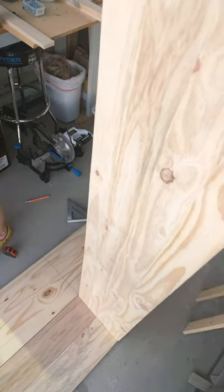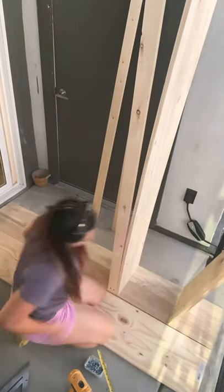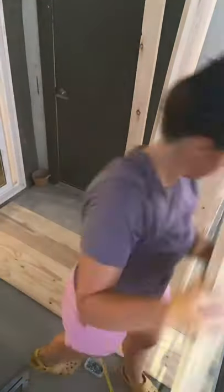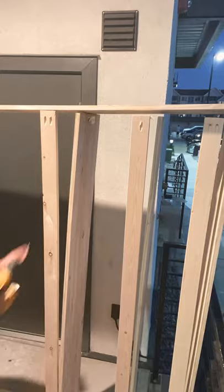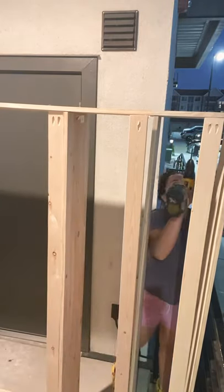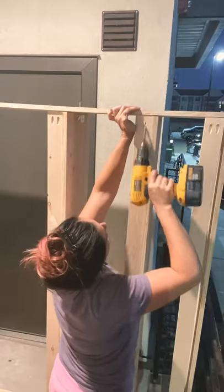I'm using one and a quarter inch Kreg screws to attach each piece — the shelf right along that line and then the one-by-three right behind it. A lot of these pieces weren't completely straight, and on my balcony I don't have a way to plane or join them to straighten them up, so I'm just trying to find the straightest pieces I can and muscle them together. It worked out really well once I got the top piece on. To attach the top piece, I flipped it over so the markings I made were visible underneath and attached with Kreg screws right along those lines. The second shelf is 12 inches above the first one, and then the top shelf I inset about a quarter of an inch down from the top. And that's the basic structure.